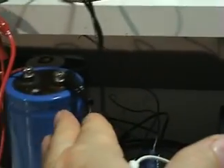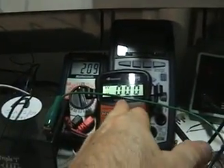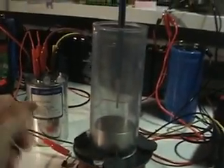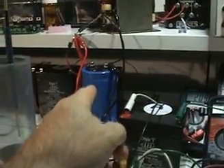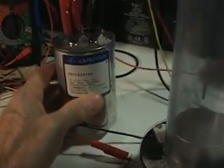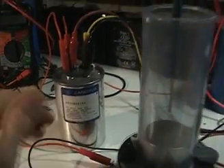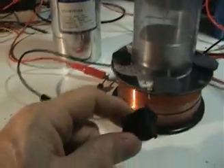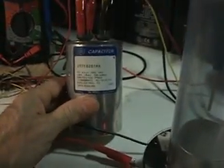The second capacitor is 57.61 microfarads, capable of 346 volts AC — it's a motor run capacitor and I'm putting DC into it, which is fine. Once that capacitor is charged to 200 volts, this meter reads 200 volts and the other is at zero. What I'm trying to determine is joule value, so I've got a fixed joule value charged at a fixed voltage to accurately calculate performance between recirculating the flyback or not.